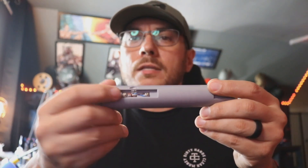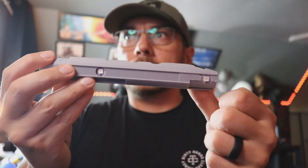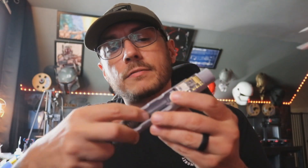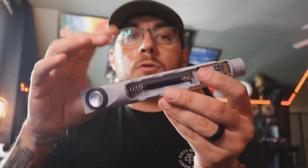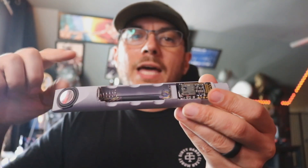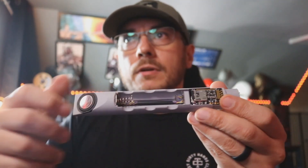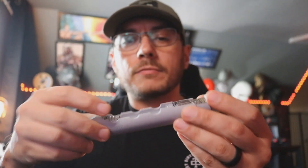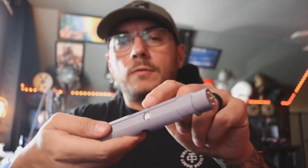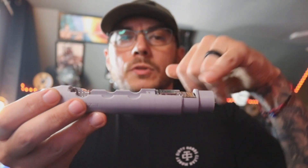You've got your power and aux here. Flip it over — you've got your NeoPixel accent right here and then another one over here by my finger, and those are for the lenses. There was not enough room for me to hide my wiring like I would normally try to do, so I just put it in some shrink tube. I had to run all three wires for the NeoPixel accent past the battery, then the two wires for the speaker past the battery, and then the wire for the negative side of the battery terminal past the battery. All the wires for the switches and also for this NeoPixel accent come into the chamber right before the battery ends and they all go to the board.